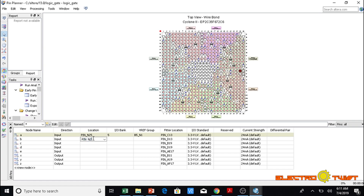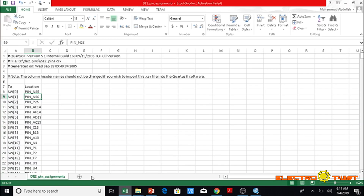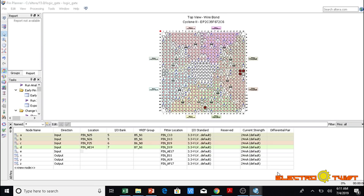The OR gate inputs C and D are assigned to pin P25 and pin AE14 respectively. Then we look at AF14, which is Switch 4, and we declare it as the NOT gate input E with pin AF14.